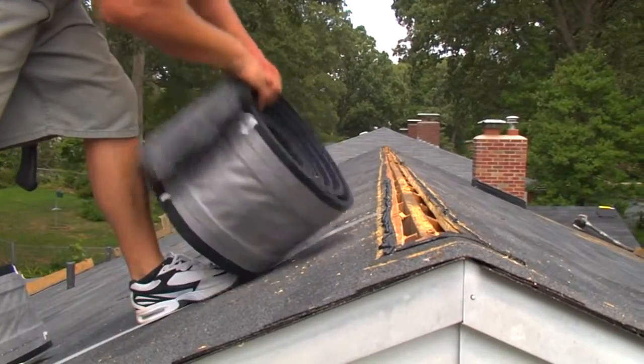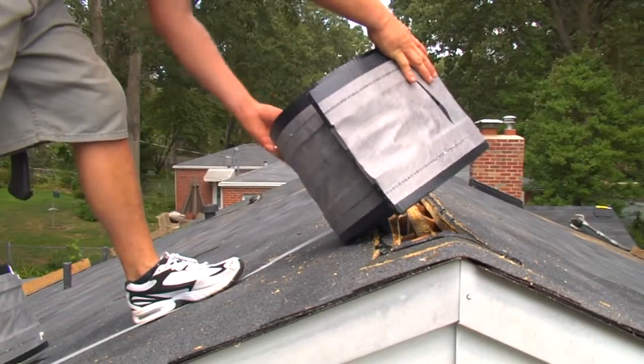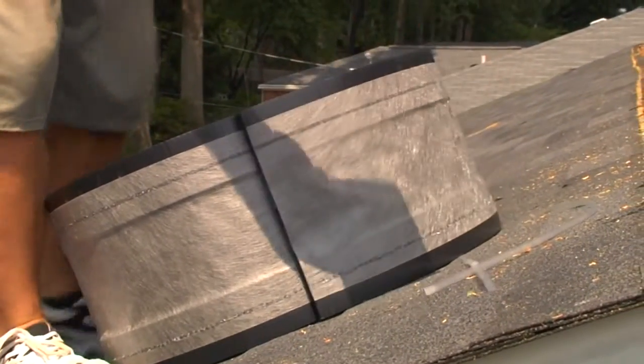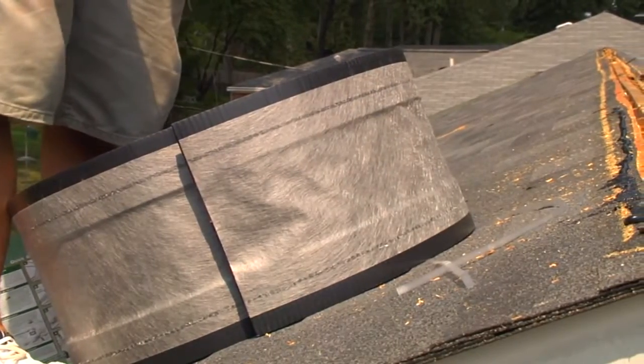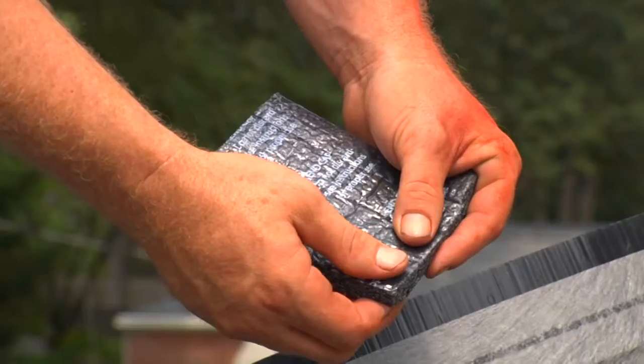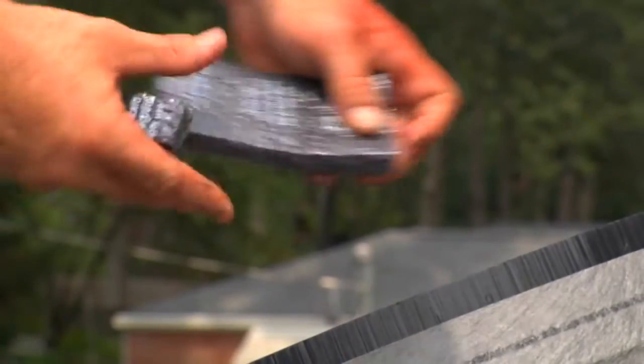Locate the foam end caps that come with the product. In the Ridge Vent Rigid Roll R Series, they are located 3 feet into the roll. In the Ridge Vent S Series, they are stacked between the 4-foot sections. There are 4 end caps in each end cap block. Pull apart 1 end cap from the block.